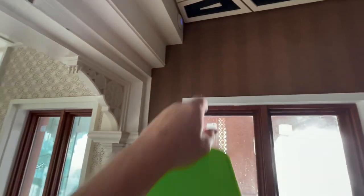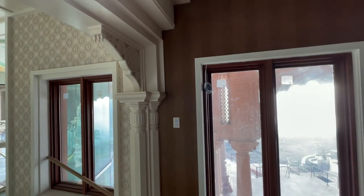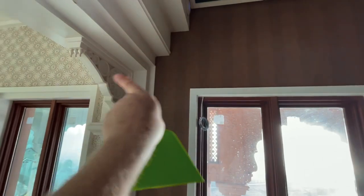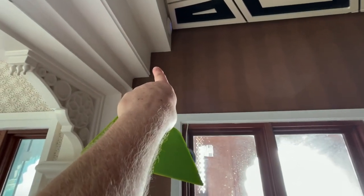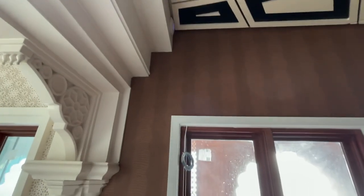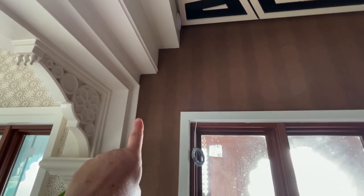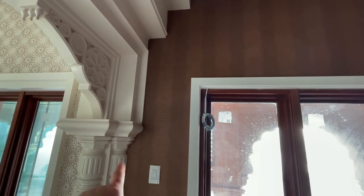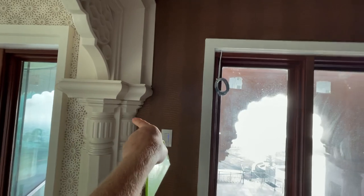Well, this sheet starts right here. This is 54-inch vinyl. One of the mistakes you can make when you're new at hanging paper, but you're good at it, but you're still new, is to forget the furthest point on your forward edge. You could mistakenly think it's there or here, when in fact, it's here. That's a common mistake we as new paper hangers make. You might say, well, I only need 37 inches. No, you need 41. No, you need the whole 52 inches of the strip, because your wallpaper goes over here. So you could cut this whole sheet and you end it right here because you forgot that you have to go over to the furthest point.